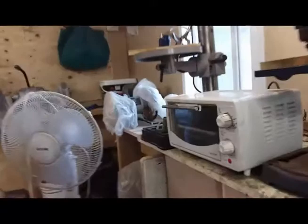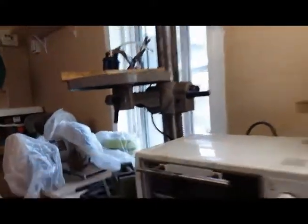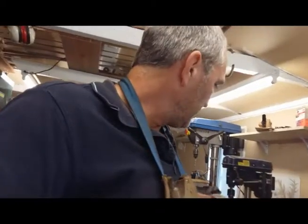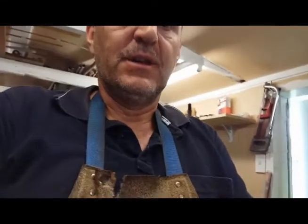And then from there, to keep this warm, into my little toaster oven, keep the temperature up, and then I've got plenty of time. The plan will be I'll do the rest of them now, and once I've done the rest of them, I won't rush, because the last one gets about 10 to 15 minutes in the toaster oven, just keeping that temperature up around the 50-60 degree mark, and then it'll be off to do the first temper cycle. So see you in a moment.